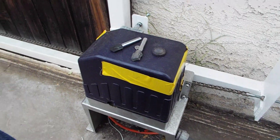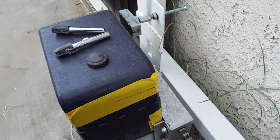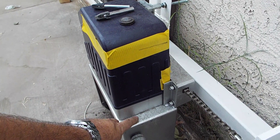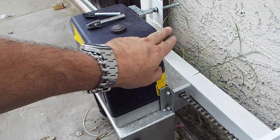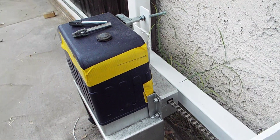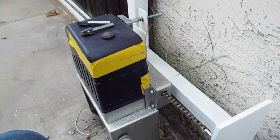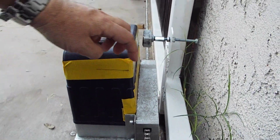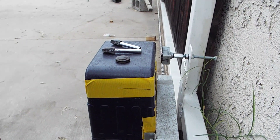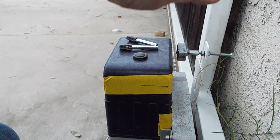With the clutch loose and power on, you can push the gate freely and see how your magnetic sensors interact with the magnetic switch. The height is critical. The instructions give you a range for the sensor height. What I did is put a piece of duct tape across the area and marked where the sensor needs to be — that took a lot of guesswork out of it, so I could figure out that my sensor needs to be centered right on that line.